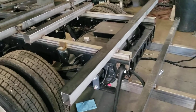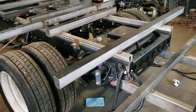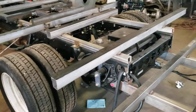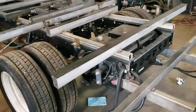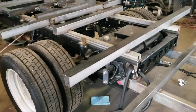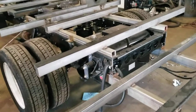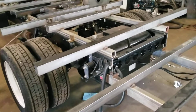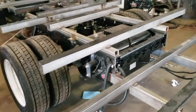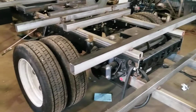One, just to help protect the coating underneath the panels that are going to sit on top of it, because it is powder coated before it's built. It can also help with some vibration type issues. Also, aluminum and stainless steel together can help the corrosion process, so by putting that rubber between there, it should prevent that. So many reasons that we put that rubber on there, but it really should do its job